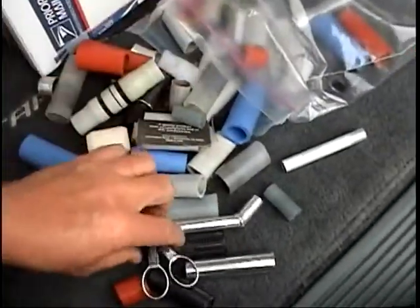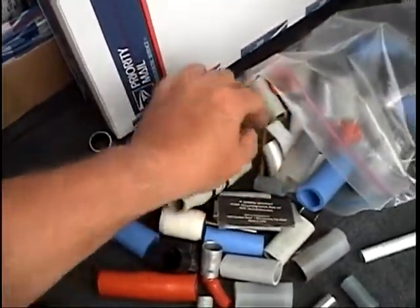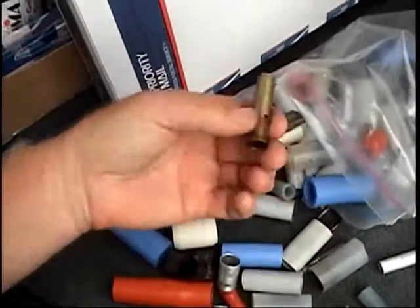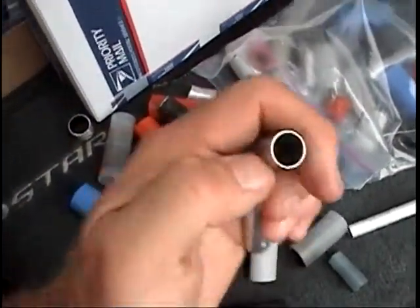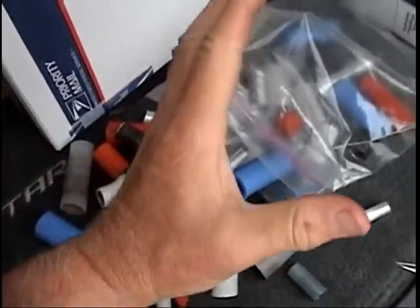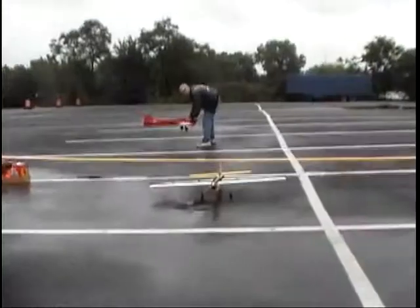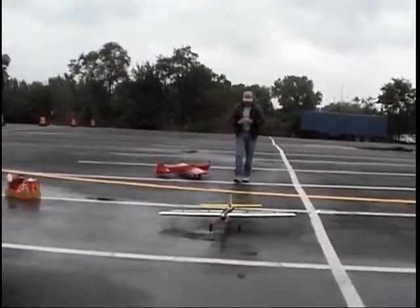But this is what having all these little adjustments is about. I got different stinger diameters, different kinds of rubber, different little baffling things, but the ultimate thing is to find out which one of these diameters is going to be ideal. And then we can make an exhaust system. Still got the other stinger. Oh, okay, we got to cut that out. We're going to swap stingers right now.